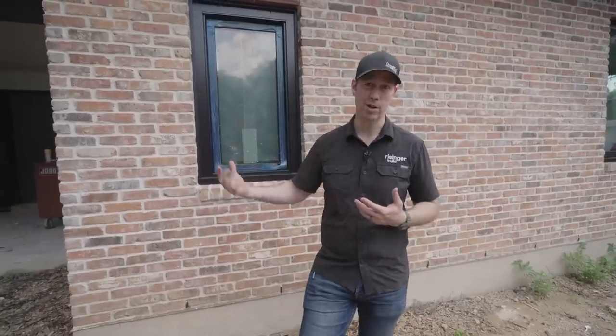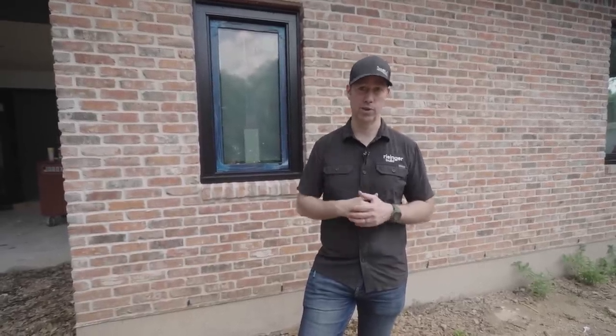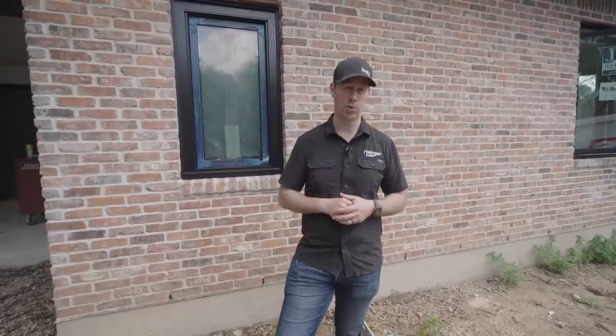I couldn't do that here. I think that these gutters are gonna last a long, long time. I'm gonna get decades of service out of these. But had I had my druthers, I would have done something like this Freedom Copper or even a real copper. You have to think about patina when it comes to real copper. In the South, it tends to brown and not quite go green like it does in other parts of the country, especially where we get freezing weather. But man, super, super longevity.